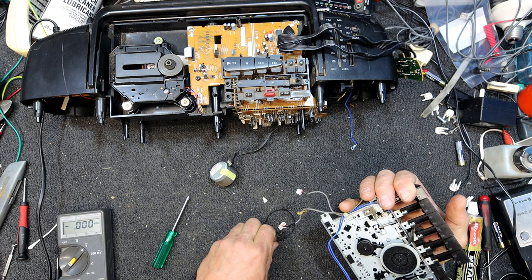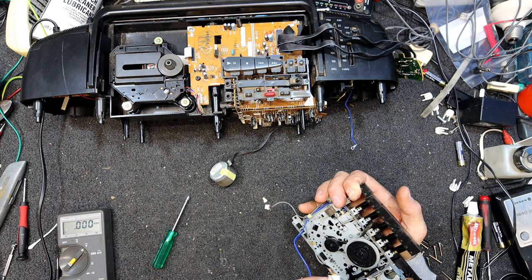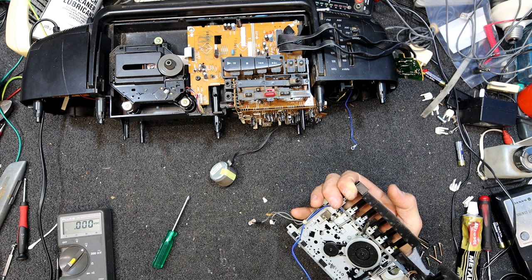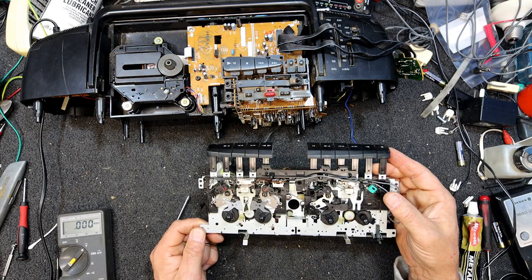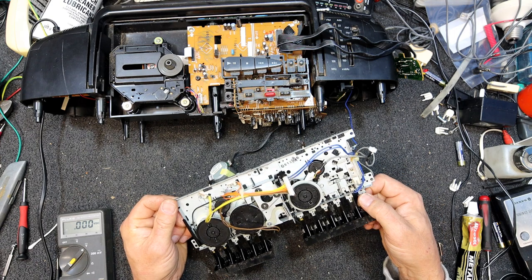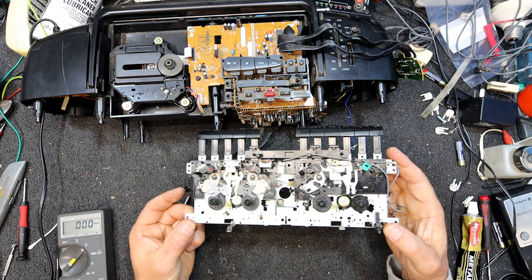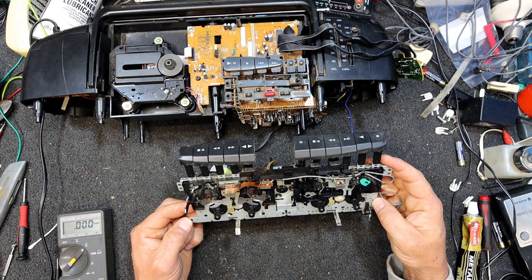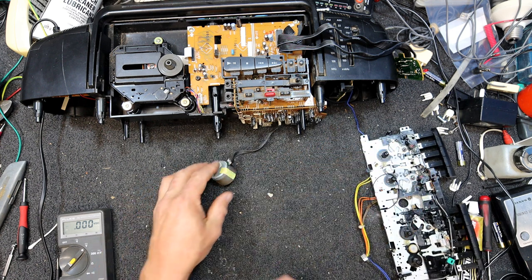And we've got a belt dropping out. Yes, it's got a big long belt on one side and pretty much a standard Tanashin belt maybe on the other, with a standard little reel belt in both, probably. Yeah, this deck's kind of flimsier or less substantial than I thought. Don't know why. A lot of their auto reverse decks are a bit more solid in a way, but I guess it's all it needs to be. Is it actually built on the same chassis as that? No, it's definitely a different stamping. Yeah, oh well, that's kind of interesting.